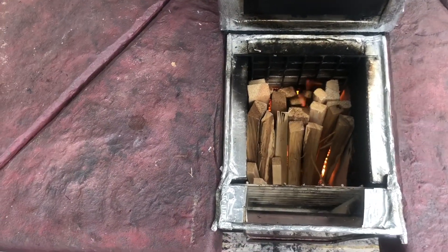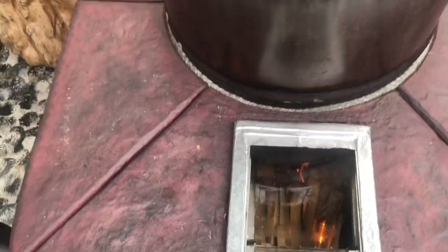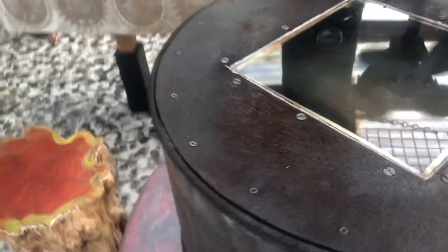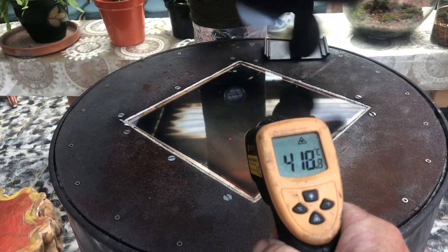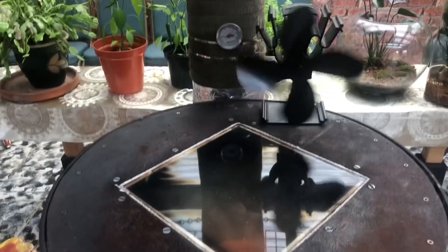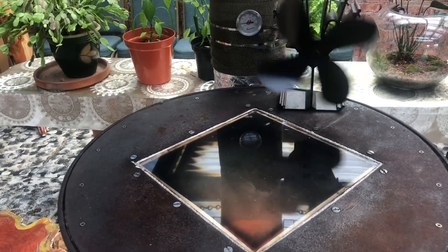Here's a picture showing the double-glazed glass front which is the air supply. Just a few minutes after lighting the fire — literally two or three minutes at most — I close the lid. With my temperature gauge, we can see the vortex is really going mad already. With my temperature gun, you can see we've got 410 to 418 degrees within three minutes. The fans aren't even turning fast yet — quite impressive.